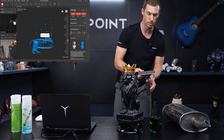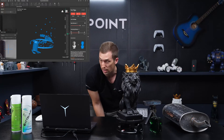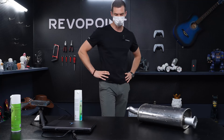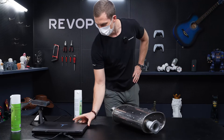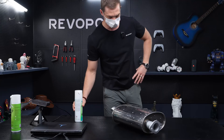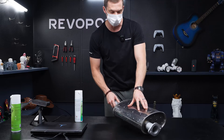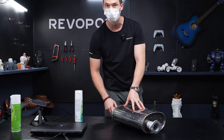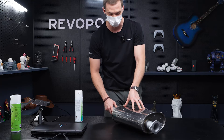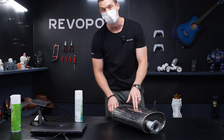Transparent and reflective — both can be fixed. Let's get some scanning spray on this. Here we are with the muffler sitting out. Notice there are marker dots already on here. I don't advise this — we're going to spray over it and that's fine — but really the best way is not having marker dots on your object first. Spray it, then add the marker dots.